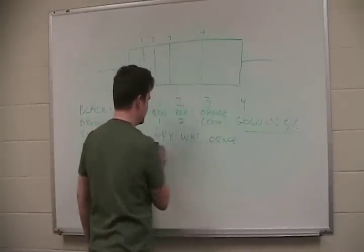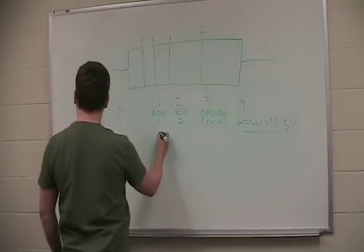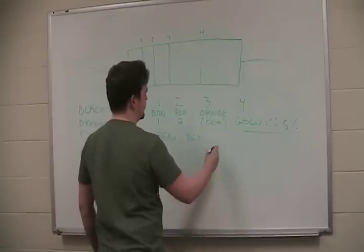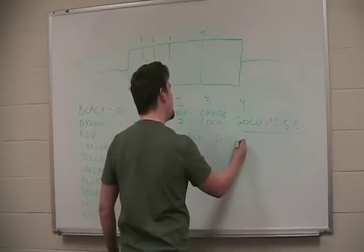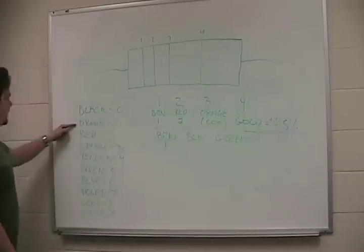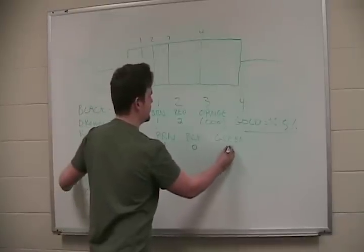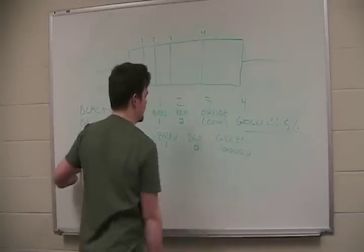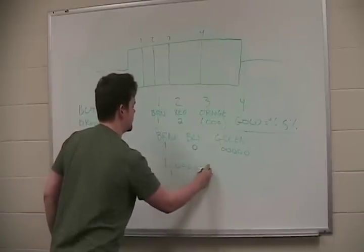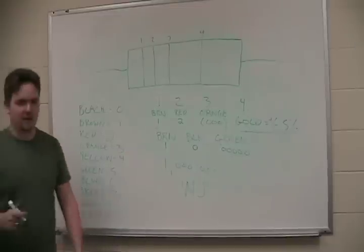We're going to do a couple more. I use this one all the time. I use brown, black, and green. Can we do this together? Brown, 1. Black, 0. Green, 5 zeros. 1, 2, 3, 4, 5. So what do we get? 1 plus 6 zeros equals 1,000,000, which is 1 mega ohm. 1 million ohms is 1 mega ohm.